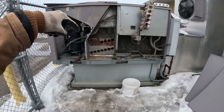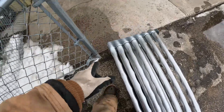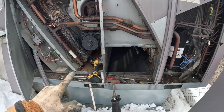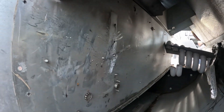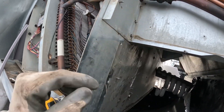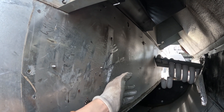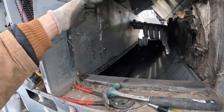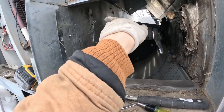We also had to take off the panel on the other side and remove the screws, because the bracket that supports the heat exchanger is way at that end. On this end we got it scooted out, but we had a really hard time with these two screws right here — the blower assembly is mounted right over where those screws would normally be taken out, so you can't get access to them. What we ended up doing was cutting two of the tubes so we could get in with the Sawzall and just cut them off. When we slide the new one in, we'll mount it from this side.